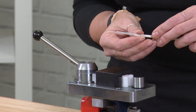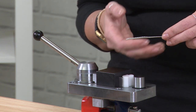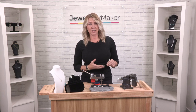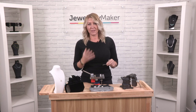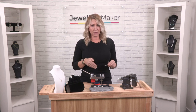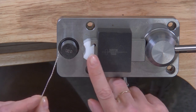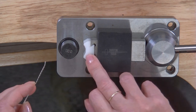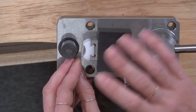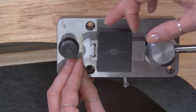To make a ring, I'm going to take some of my decorative wire. What's always good if you can is to anneal it first — that means to soften it. Introduce heat to it, get it nice and warm, then let it cool down, and that just means the metal is softer when you want to get those nice curves. I've got the die and post in and I'm going to work with the Delrin one so we won't have any marks at all. If you do get marks on your wire, that's absolutely fine — you can just go over afterwards and tidy up a little bit.